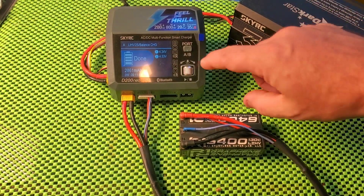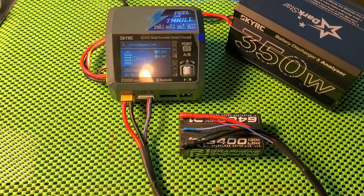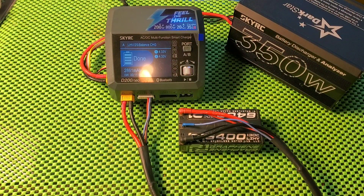You can see that as it's sitting here, the voltage is decreasing. It's no longer 4.35, which it stopped at — it's now decreasing to 4.3. It seems to be because it prematurely stopped. It brought the current down to about 2 amp and then just shut off, and it didn't actually charge it to full or up to its limit. So you can see it's slowly backing down. What I've tended to do is I've had to charge it two or three times to bring it up to the 4.35.